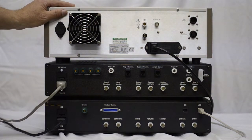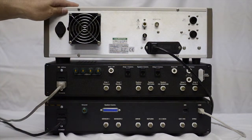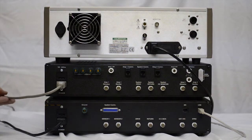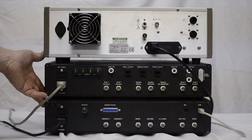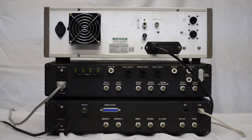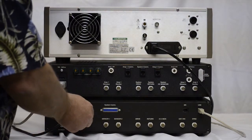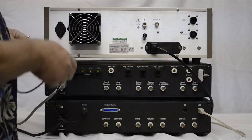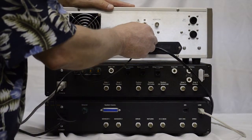The first connections to be made are the power connections. These are switchable power supplies that can operate from 120 to 240 volts. Importantly, they must be connected to an AC power supply that has a firm earth ground — without a firm earth ground, we have seen damage to equipment that is not covered under warranty. The equipment also needs a common ground between instruments, so we take banana cables from the green ground pin at the tester rear panel to the green ground pin at the HVI rear panel, and then from the HVI to the ground pin at the amplifier.